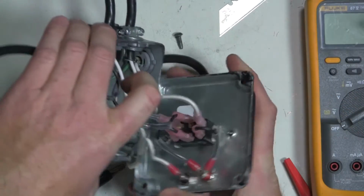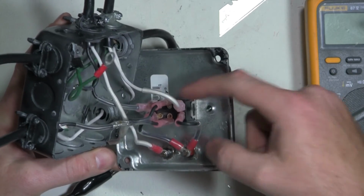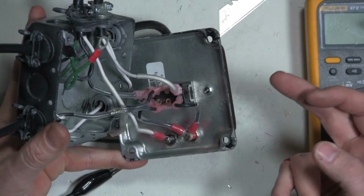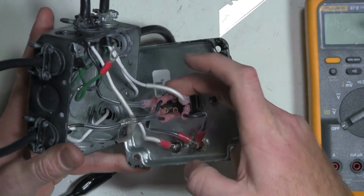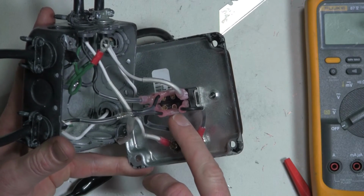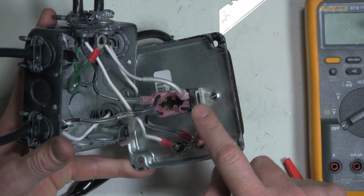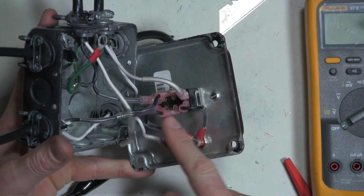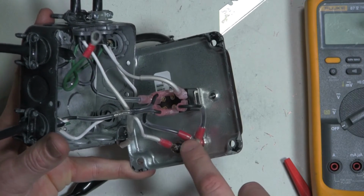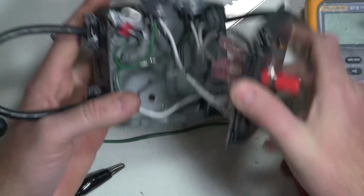So again, my mistake was that I did not energize one side of the switch. So with this, I'm energizing the switch to do what it's supposed to do, which is send current to whatever my load is, and then I am energizing the second part of the switch, and I am just using that for a voltage reading. So I'm going to be flipping it to closed position here, closed position there, and that'll energize these terminals, but only when the switch is on. So let's put it back together and see what we get.